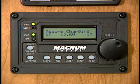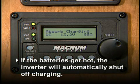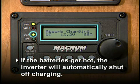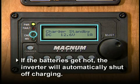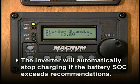Let's cover some of the other things the inverter can do for you. The inverter remote allows you to program the inverter to handle several different functions so you don't even have to think about them. For example, if the batteries get hot, the inverter will automatically shut off charging until the temperature returns to normal — this will avoid damaging your batteries. The inverter will also automatically stop charging if the battery's state of charge exceeds the recommended voltage to avoid damage to the batteries.